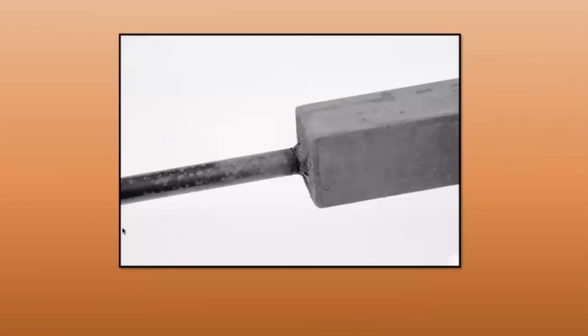I'm using about a 12 inch long piece, and I'm looking for something that can be held in the vise easily and rest on the vise pin to stop it from pivoting in the vise jaws. And then onto that, I've got a welded handle. You could use a pair of tongs if you had them available. I don't care to grip a pair of tongs for the length of time that it takes to make these things. So that's just a piece of half inch round welded to the back, and that makes enough of a handle for me to be able to carry on and work.